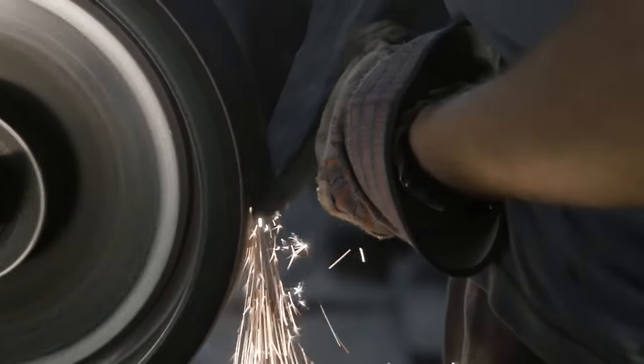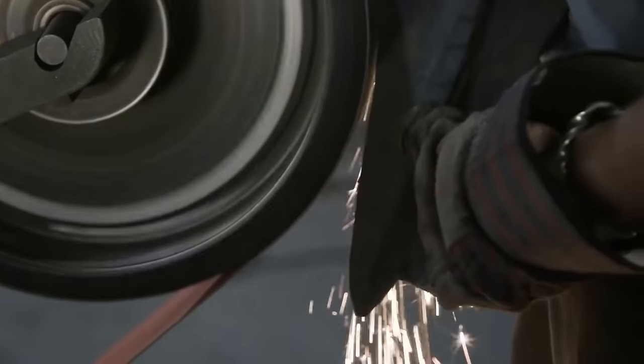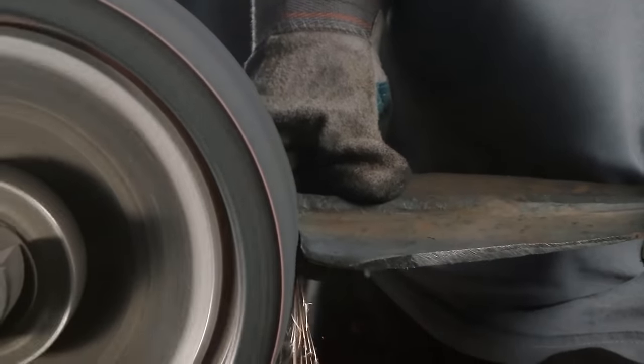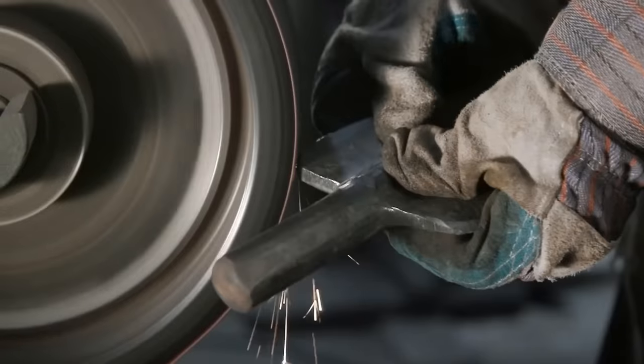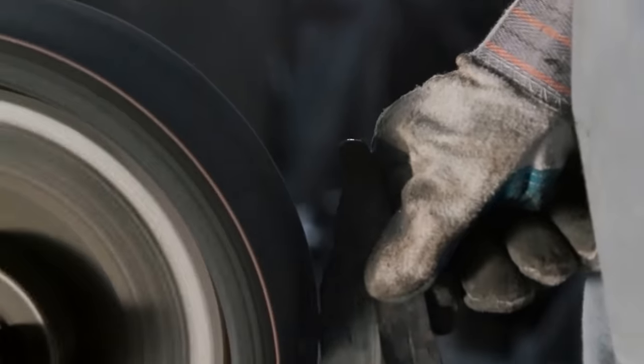It's now my job to go in and just clean up the perimeters and then move on to sanding the blades themselves, being sure that I leave enough thickness to the blades that they heat treat nice and safely. Since there's a lot of central mass on the center of these blades, it could cause a lot of warping if I grind them too thin.